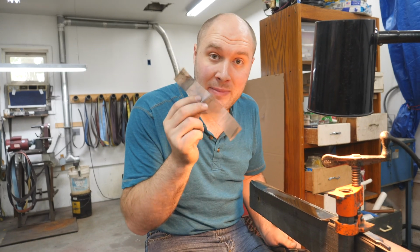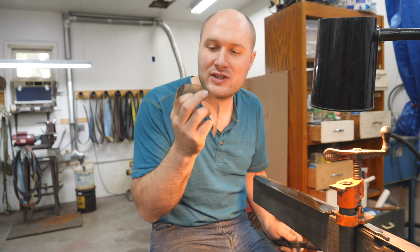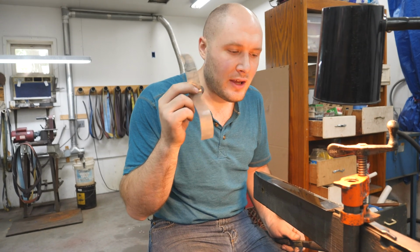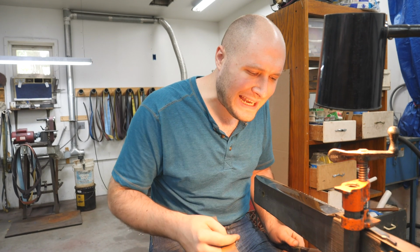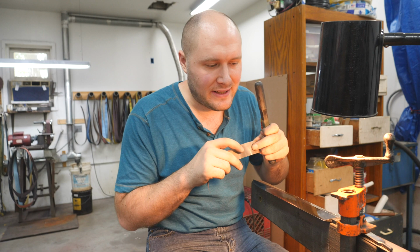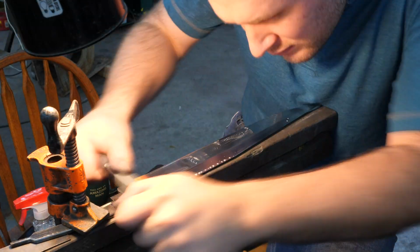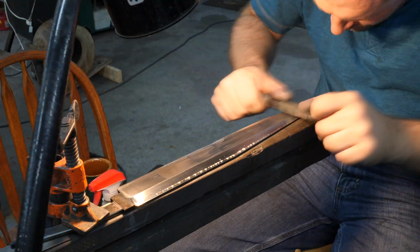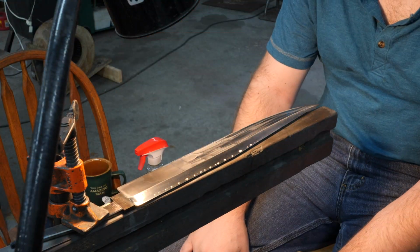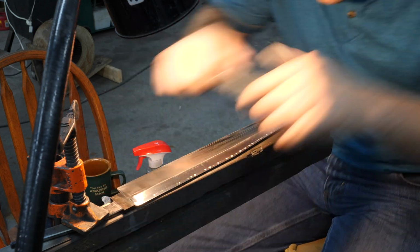That end use may be for when I go to do stone handles. This may be the perfect thing for polishing that stone since it's got diamond on it. But for doing a blade, it just seems a little bit slow. Like I just sanded on one spot basically and almost sanded an area as big as a large hunter with one little tiny spot of the paper, whereas it would take like a strip or two of this probably. So the durability of it is very impressive. Just wish it cut a little faster.